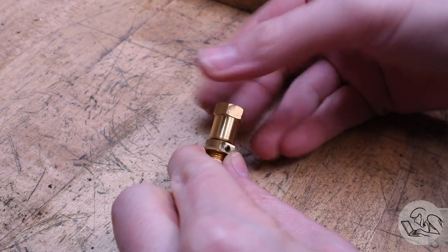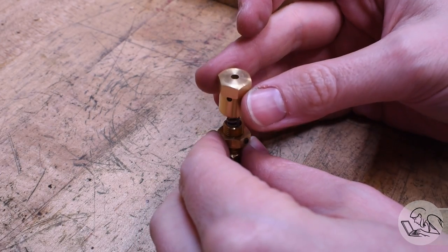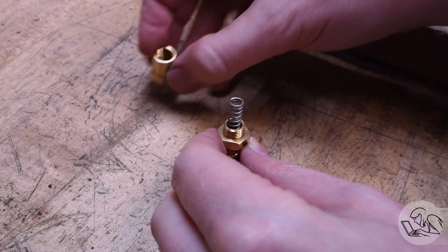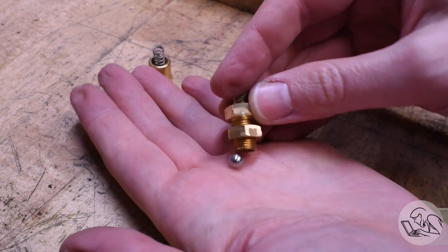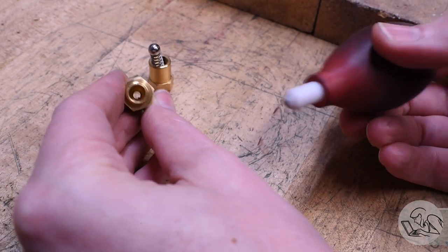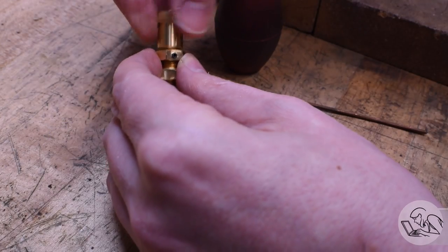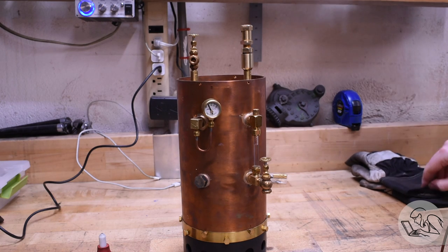Let's get this thing open and see what it looks like inside. The Stuart Models valve was $50 and the PM Research one was $15, so I'm expecting more sophistication from the Stuart Models one. Inside we have the cap, which removes, the stainless steel spring as expected, and down in the business end there's a ball and a seat. Yeah — it's a ball and a spring, identical to the PM Research valve. Not super impressed. There is a piece of something on the valve seat, probably came up out of the boiler, just construction debris. So I cleaned that valve seat up and tested it again — that might be why it wasn't closing all the way. It blows off very nicely, but then blew all the way down to 25 psi before it finally decided to close. That's quite a bit too much hysteresis — it's really dumping a lot of steam and wasting a lot of fuel.